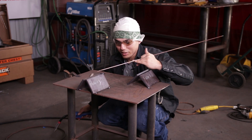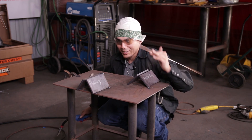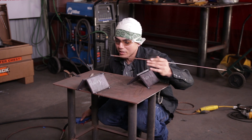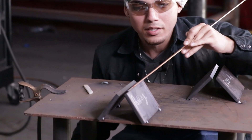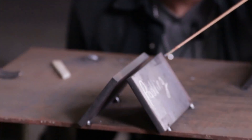Sometimes they'll say, 'Hey, just weld it out — you got an inch and a half gap, I don't care what it looks like, just weld it out. At the end let it be a consistent bead on your cap.' Sometimes you might have an inch gap and it might be x-ray — you don't know — but for GMAW you probably won't. So you're going to pad it, pad it, pad it until it gets to a certain point, then connect it and weave it out.